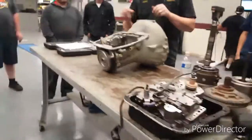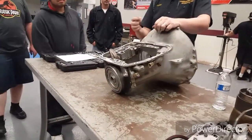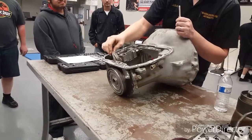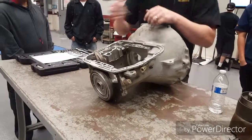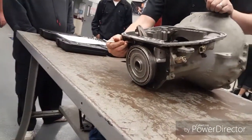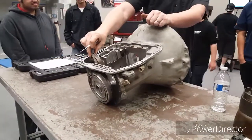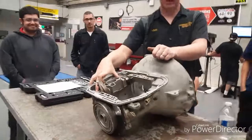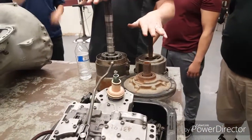The next thing I need you to do is — there are snap rings holding in these two servos, so let's take those out. Depending on which style you got, some fold out really well and you should be able to roll the part out. If not, this little rod right here — you can put some needle nose pliers in there and dig this pin out to remove it if you have to; otherwise don't. Let's get the servos out. You'll note how I have things carefully lined up and reassembled on my bench so they don't get mixed up or fall on the ground.